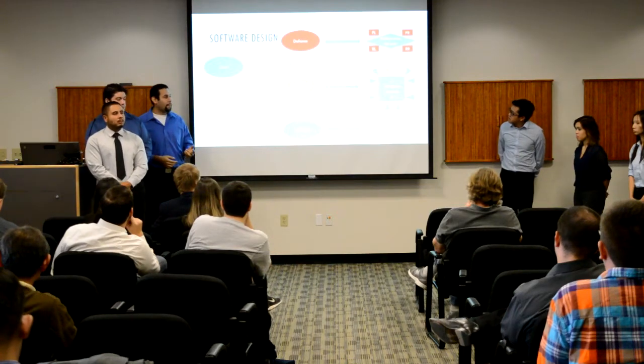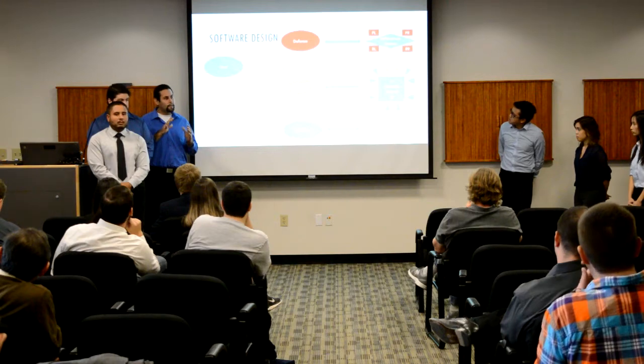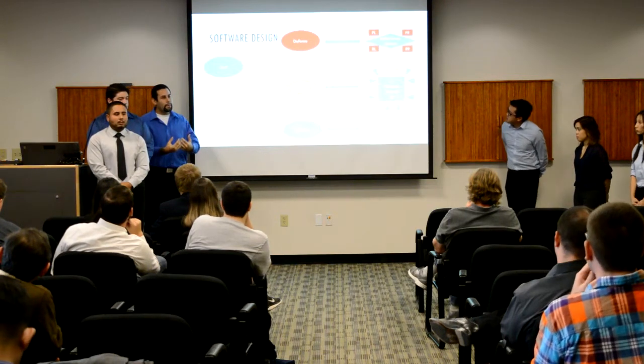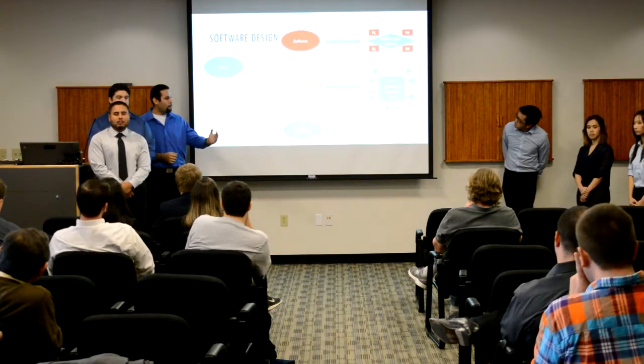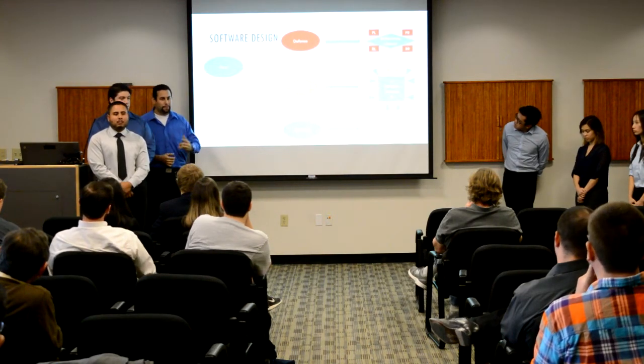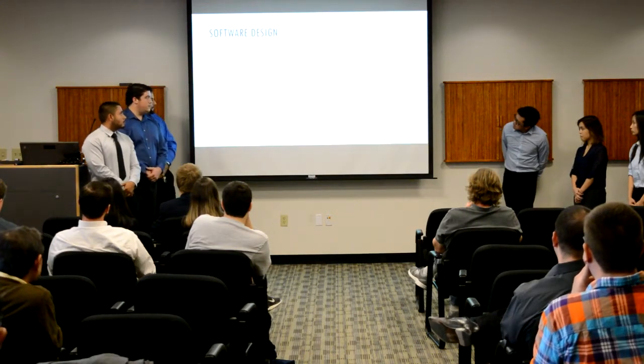If during any of the roaming search state or offense states, the edge is detected, then we'll go into a defense state. In this case, any action currently being performed will be overridden and we'll back off from the edge because we don't want to lose the match. Next, I will pass it on to Julian so he can type those into pseudocode.